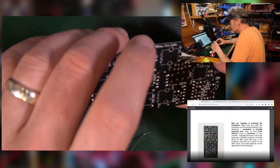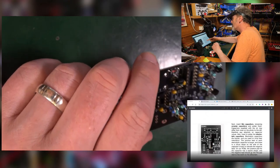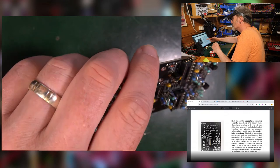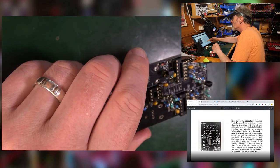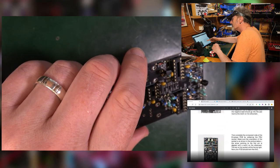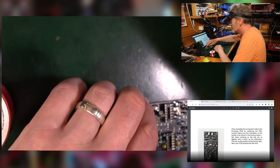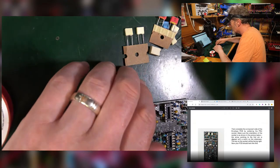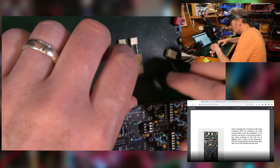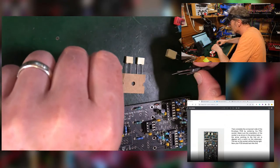Next, film capacitors. Okay. Remaining ceramic and solder them. Also the electrolytics, with those dodgy legs. Long leg, positive. We should end up with that one. Oh, okay. So that's why he didn't solder it in. It's because he's got one of these flatty ones rather than the 102, I think. Let's see if we can work this out. So we're going to put in these little fellas and then the electrolytics.